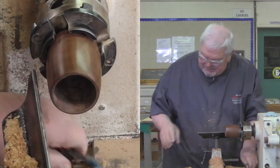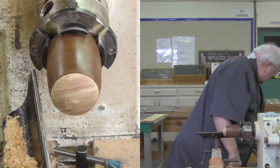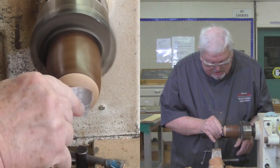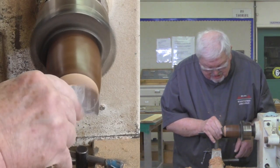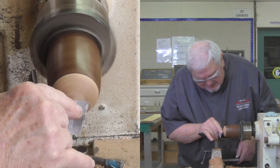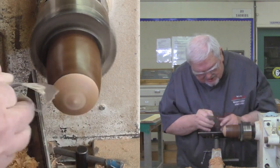Just tight enough. I can put the lid on and finish sanding. Back to my 180. Now, I'm not pushing across this at all. If you push at all, it's towards the headstock. And all the work is being done right here in the center, where the wood is hardly moving at all. So this takes longer to sand than any place else on this lid.